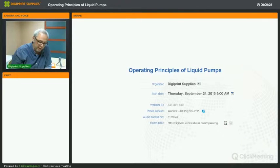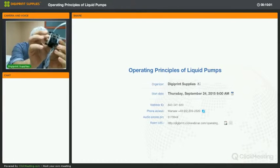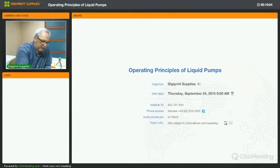What you can do to assure a good operating of your peristaltic pump is to use some silicone grease on your gears. There goes a little small part, but also on your tubes. So you just apply it on the rollers, then put the roller back, of course, because that will guarantee a much smoother movement of your pump as well. So that's how these type of pumps look like. And of course, to these 2 gears, there's one here as well. Yeah, one on this side and one on this side. They are driven by other gears, which are driven by the pump motor inside your printer.